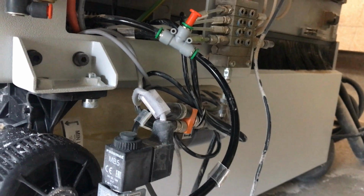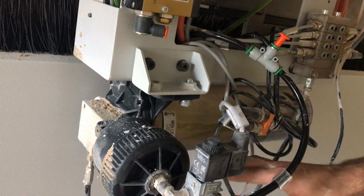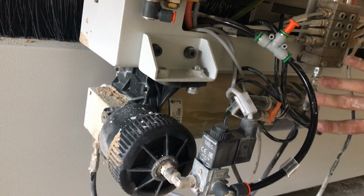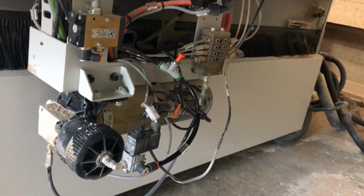So we pump a bunch in once it gets to the minimum. Yes. You don't want to pump back in when it comes to half, because that means the new grease will come here and then the old grease will always stay on the back. You want to spend all the grease, then pump the new one. Use it all, then pump new in. Okay, that's all for the greasing.